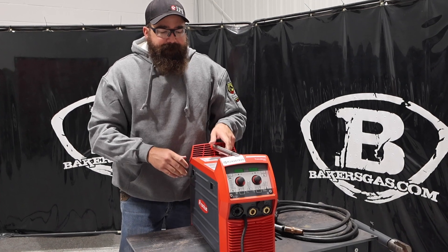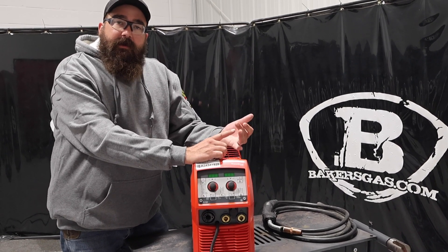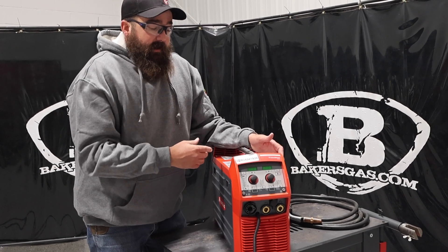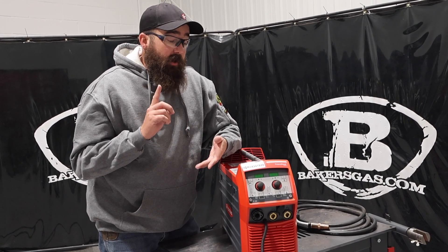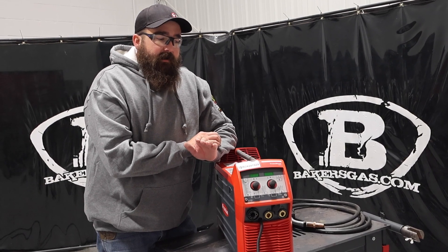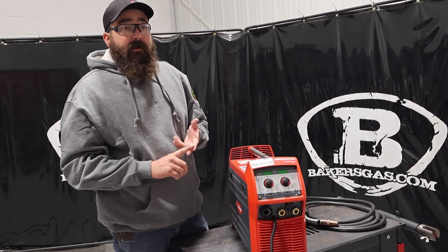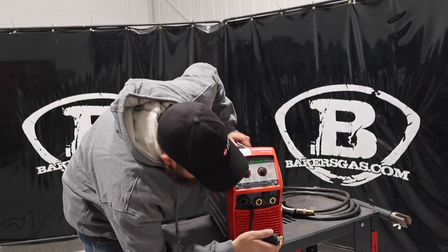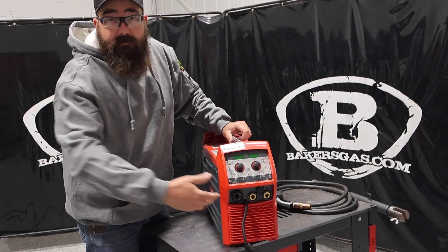You see a lot of these go into home hobby guys in their garages because they want to stick weld, they want to TIG weld, and obviously they want a dedicated main MIG machine. You can run inner shield metal core flux core, and then you can run aluminum, silicon bronze, all your aluminum wires pushing it through a gun. We'll link that other video down below. As long as you keep your liners clean and you've got the right drive rolls with the right wire, everything should be flawless. We've also got our polarity changing here — it's already linked to the machine — so we've got our negative and positive. If we're flipping from inner shield to flux core wire, or if we're doing TIG welding, we would flip that.